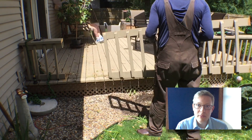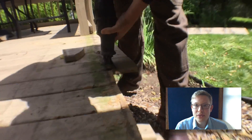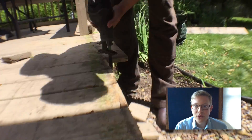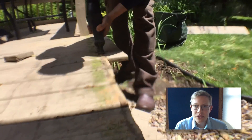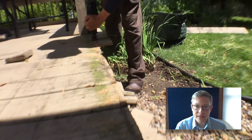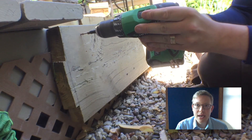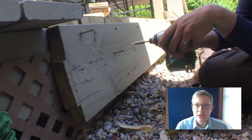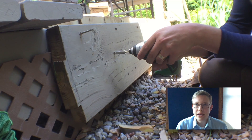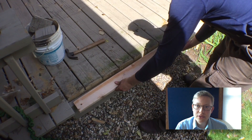I need to make a 4x4 — I'm going to make that out of two 2x4s for some stability, and then I have to use that big top piece as sort of a sturdy backboard. In this shaky shot I'm cutting the deck boards flush with the bottom of the deck, and there I am installing what used to be the top board of the railing. This is going to be a surface for a flush trim piece and it's what the stairs are going to be mounted to. There is that flush piece I was talking about.